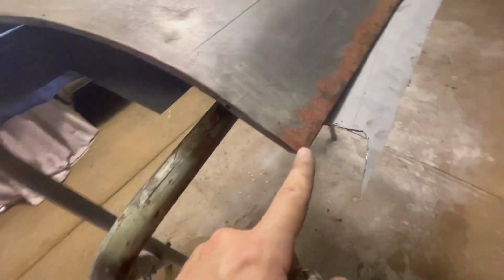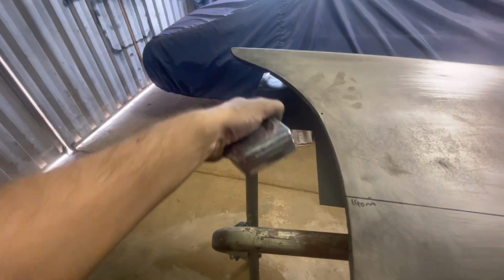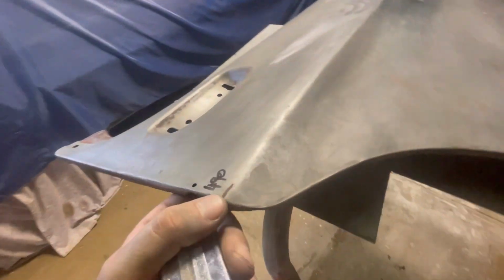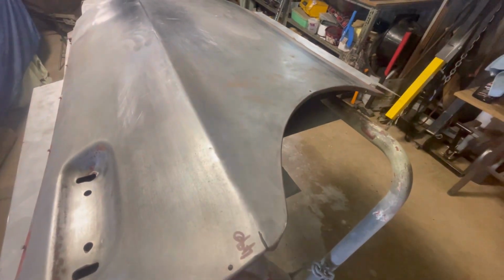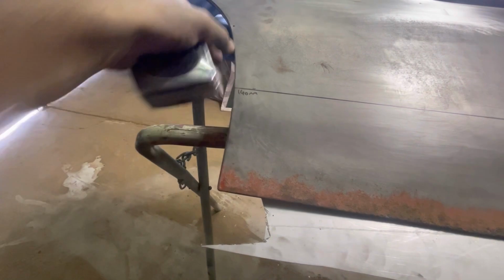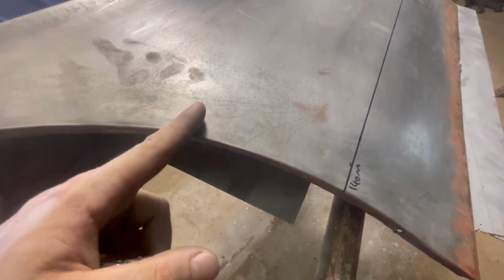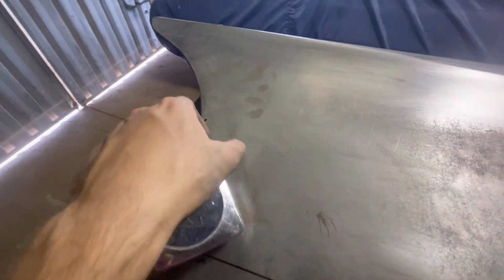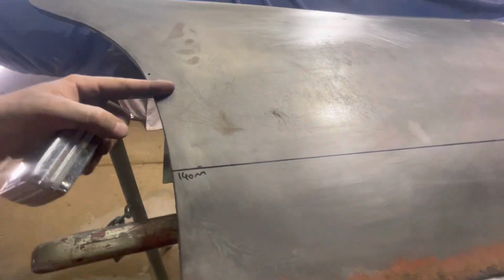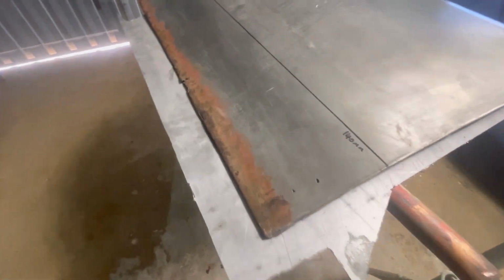And then the back of the skin, again, I've measured from the corner from here to this one right here. What I did was I just went diagonally. Probably not the most accurate, but it'll give me a close enough measurement. What I'll also do is make a little bit of a template. I'll start from about here, and then that way it can give me the shape. So I'll mark where my template starts, and put a little bit of a marker around that, and then that'll give me something to put my template to, and then that'll give me the distance from the template top to the bottom of the skin. Hopefully that makes sense. If not, if you want me to, I'll explain it a little bit further in the comments.